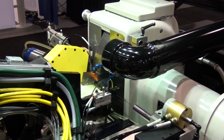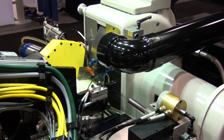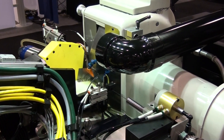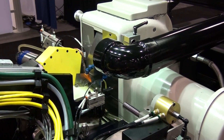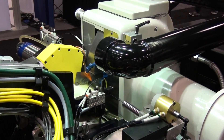You bring in a spool of wire and it delivers completely ground complex part profiles. This machine is completely automatic. It has CNC wheel dressing, two independent slideways — one for each grind zone — a coolant filter, an enclosure, a mist collection air filter, and raw material is fed automatically from a spool.